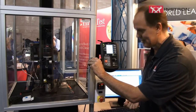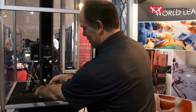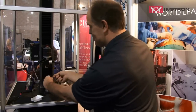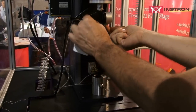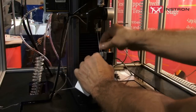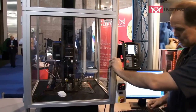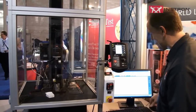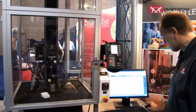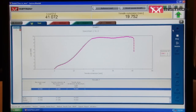The first and most important thing to do is to actually see how a test would be run inside this chamber. First, we would open the lower door, very nicely ergonomically designed to allow folks to get in here and put their specimens in the grips. I've got a suture material that I'm putting on these cord and yarn grips. I clamp the top one first, then the bottom one — these are pneumatically driven. I close the door. You can see that we're actually performing the test at 37 degrees C. I use our Blue Hill 3 software, click the start button, and you start to see a stress-strain curve as the grips move apart to test the strength of the material.